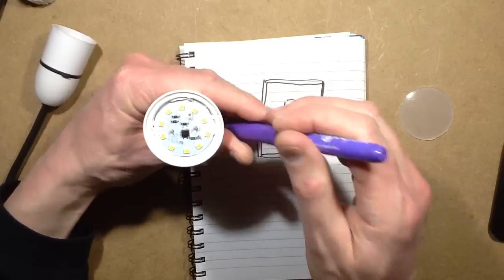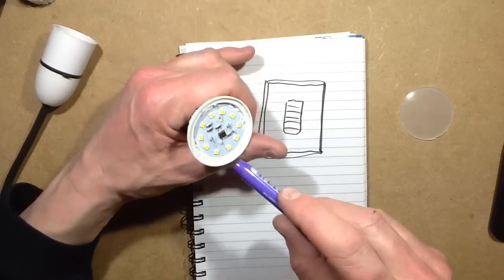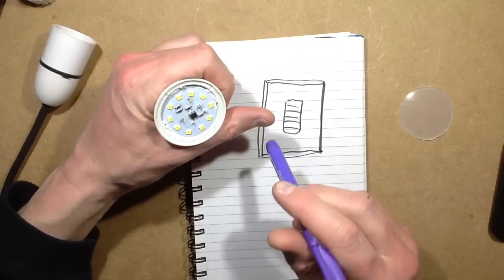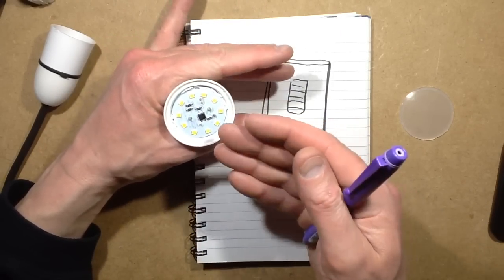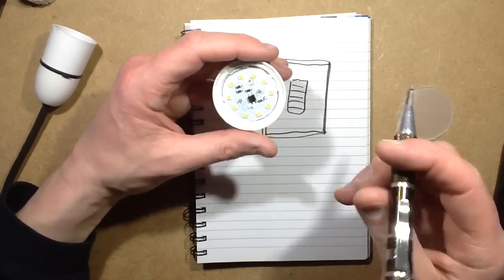So if you consider there's 10 LEDs, round about 17, 18 volts each, it's going to be 180 volts, and you suddenly realise this. These LEDs are optimised for capacitive droppers, because that makes it a very efficient way of using the capacitive dropper, because you need a lower value capacitor. Talking of which, I haven't found that out yet.